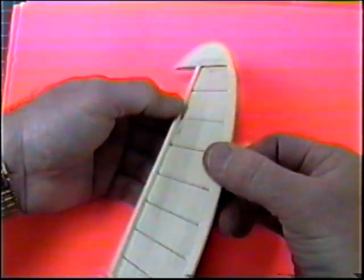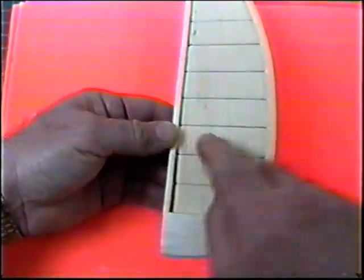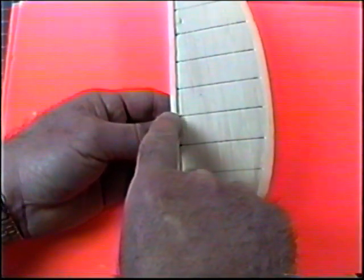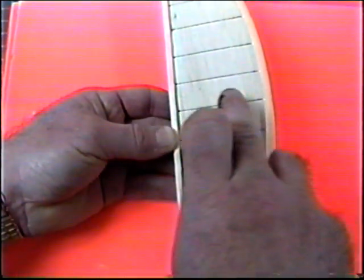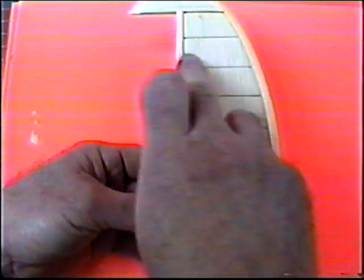All right, back to making this rudder. Now what I need to do is lay out the largest rib, which will be this one. Strip off some wood this thickness. I want to make 1/8 inch. Strip it off so that I can start with this high point and just put a gradual curve in here, and then I can exponentially shorten the curve on each piece.